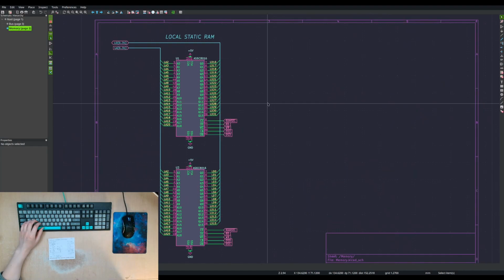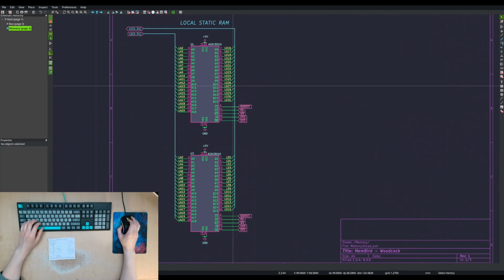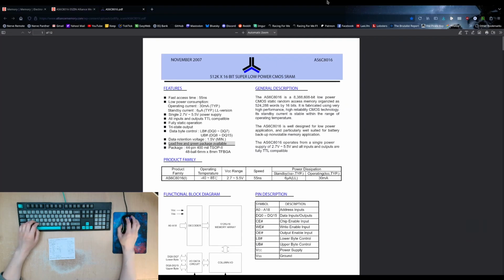Now, in this case, the ones that I used from the previous, this is the K30P, as I mentioned. I have 2 chips on that, with the data signals for the upper 16 bits going to one and the data signals for the lower 16 bits going to another. So it's a full 32-bit interface, but again, we're not using that on this card. We're not going to be doing an A40 cycle. I guess I should explain that quickly as well.